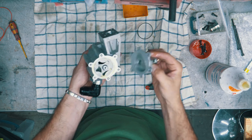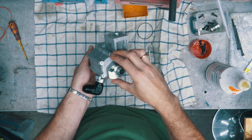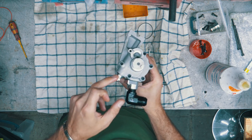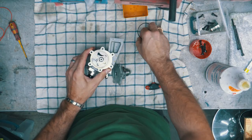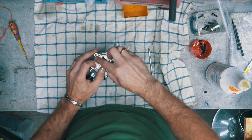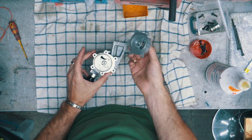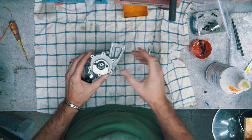So make sure those passages are opposite each other, otherwise the pump will not work effectively. What it will do instead is run oil around the same chamber in a circle without actually creating any pressure. And don't forget the O-ring — you definitely don't want to run a pressurized system without any kind of seal. Make sure the cut-out is on the opposite side, then align it and fit it.